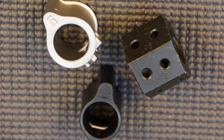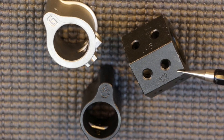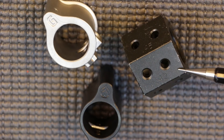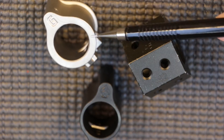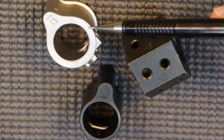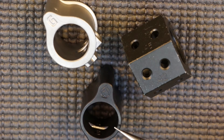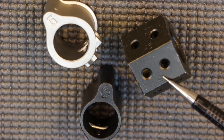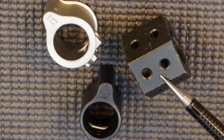To better explain the versatility, here are examples covering all three sizes. The BCM low profile gas block has a center-to-center spacing of 0.46 inches. The Geissele captures the low end of the spectrum at 0.42 inches. And on the highest end, the Ballistic Advantage low profile gas block has a center-to-center spacing of 0.5 inches. I'll be installing the Ballistic Advantage gas block on a barrel in this demo, so we'll be using the half-inch spacing.